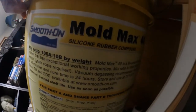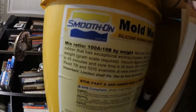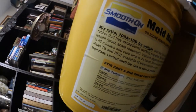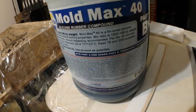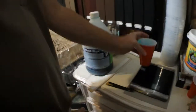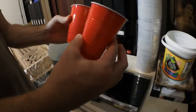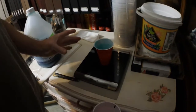Let's cover the products. This is a standard Smooth-On Mold Max 40. It's a mix ratio of 100 of Part A to 10 of Part B by weight. This is the Part B, which is the tin-based catalyst. We've got our scale to measure things. I also have my catalyst cup that I mix here, and I have a tear cup — the exact same cup. I just turn it on, tare it, and place that over there, and it gives me my exact weight amounts.